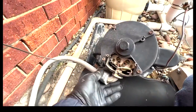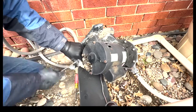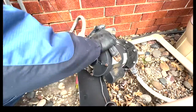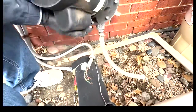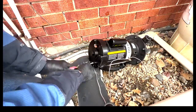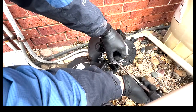Now we've got the electrical loose. Sometimes these wires can be quite a pain, but we'll get those pulled apart. Then we'll remove the conduit connector and pull this old pump out of the way. Now we have our new pump — the first thing we'll do is remove the dust cap and then remove the screw where the conduit will connect to the side.